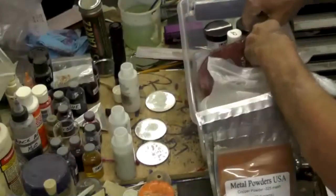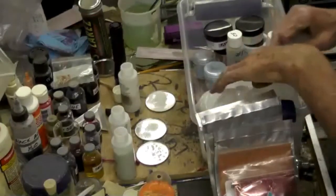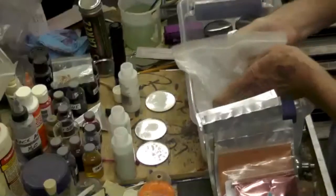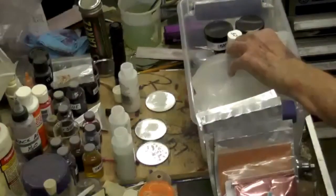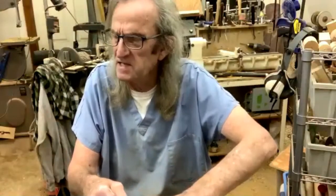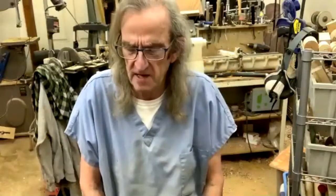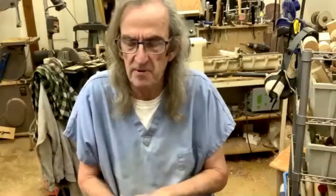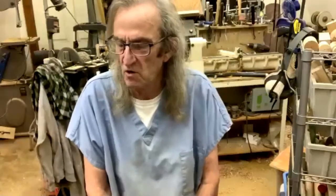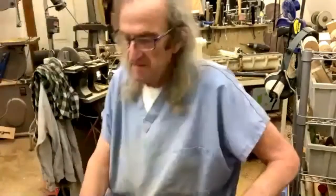When you say you're crushing the material, are you using a coffee grinder or smashing it with a hammer? I put it down inside a stainless container — I think it was an old drink shaker — put a glass on one side, put a piece of heavy steel bar inside, and just beat it down on the bottom. That controlled it. I just beat it up, crushed it, and then ran it through sieves to get finer stuff in different sizes.